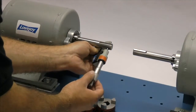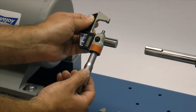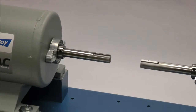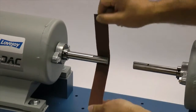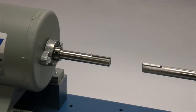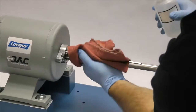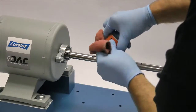You should measure the shaft and ensure the shaft diameter matches the coupling bore size. Then inspect the shaft and clean off any nicks or burrs from the keyway or shaft diameter. A fine tooth file can be used to clean burrs from the edge of the keyway or large dents in the shaft, and emery paper can be used to clear the shaft of rust or any fretting corrosion. Finally, using a cloth and cleaning solvent, ensure the surface of the shaft and the keyway are clean and free of dirt. The hubs should also be cleaned to remove any coatings used to protect them during shipping.